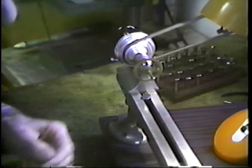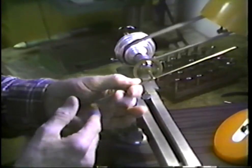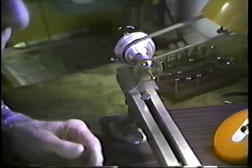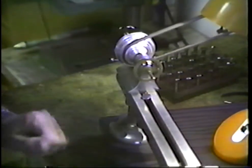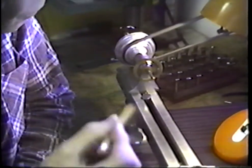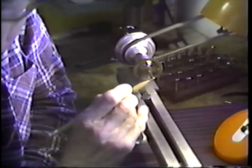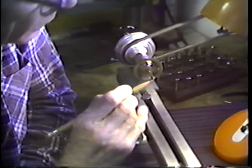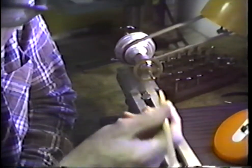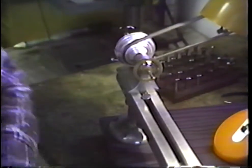And to catch the tremor, you remember, if we want to catch the tremor, we can magnify it by going out onto the end of a rod. That is essentially perfect in where it's running. We might imagine that all we have to do is to go right in here and skin off this little bit of the pivot that remains, that we would locate the center, that we'd run a drill in it.